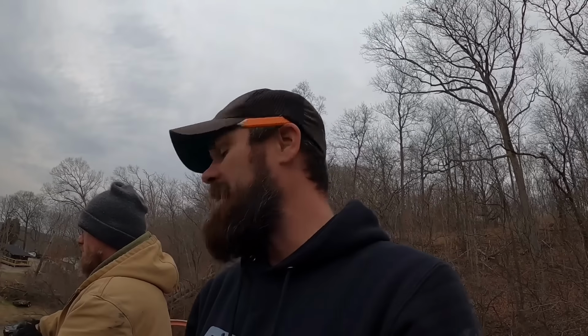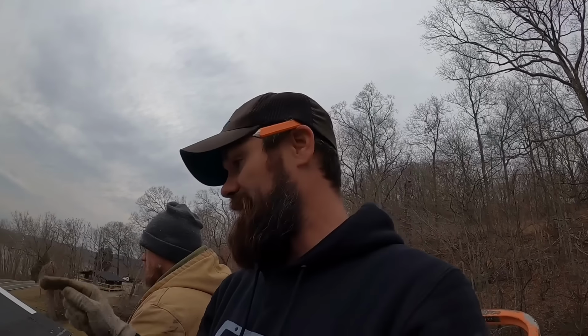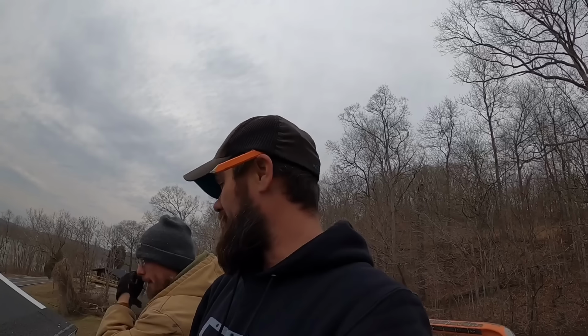So that entire roof down there has starter strip, but it's not really installed correctly. I think it's gonna be fine. And if all else fails, I can run some blackjack right along that bottom edge to make sure it sticks. So yeah, I messed up. This is the right way. Do not follow my instructions earlier and or my complaint. I'll leave it in the video. I won't take it out, but here we are. Made a mistake and we figured it out. Now we're doing it right. Yep. Let's keep going.